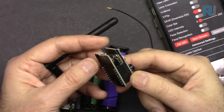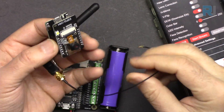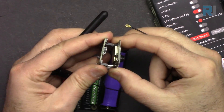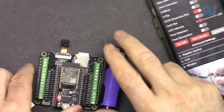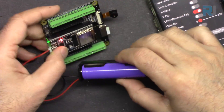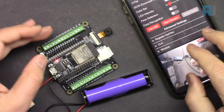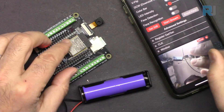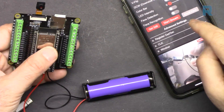I have a separate video explaining the ESP32 camera module — it has been viewed over 100,000 times; the link is in the description below. However, that standalone module has all its ports blocked, so you can't do much with it. With the SunFounder ESP32 module, there are pins available that you can program and do other tasks, it comes with a battery, and you can stream video over your Wi-Fi network. This tutorial is about streaming video over the same Wi-Fi network — the stream speed depends on your Wi-Fi router.